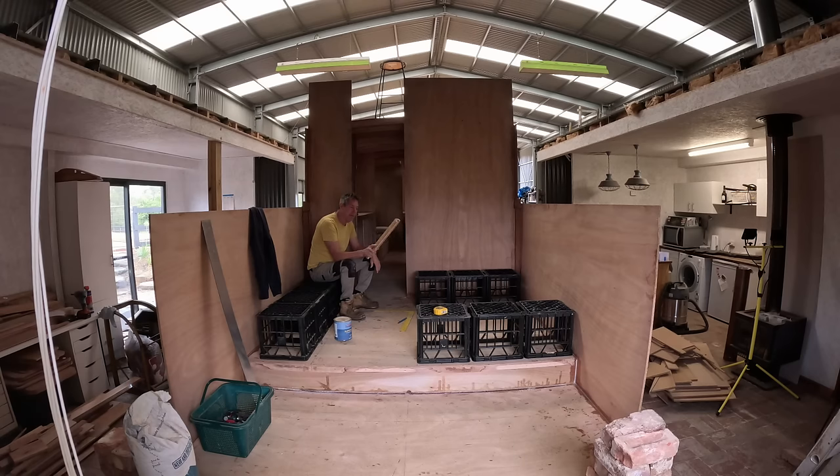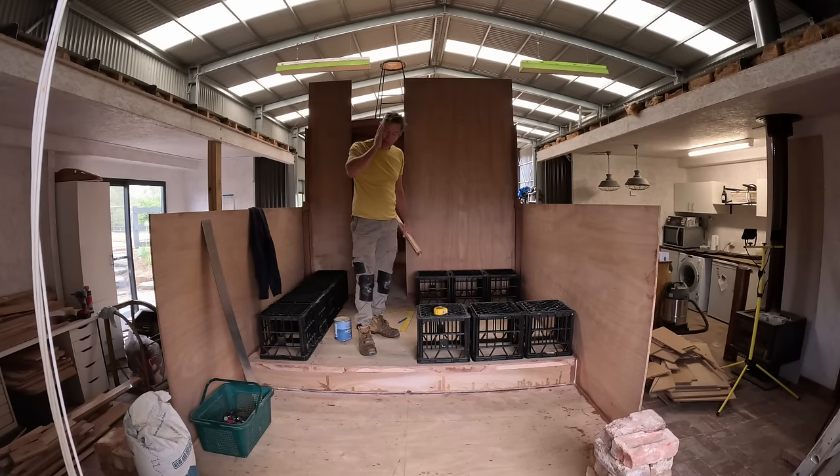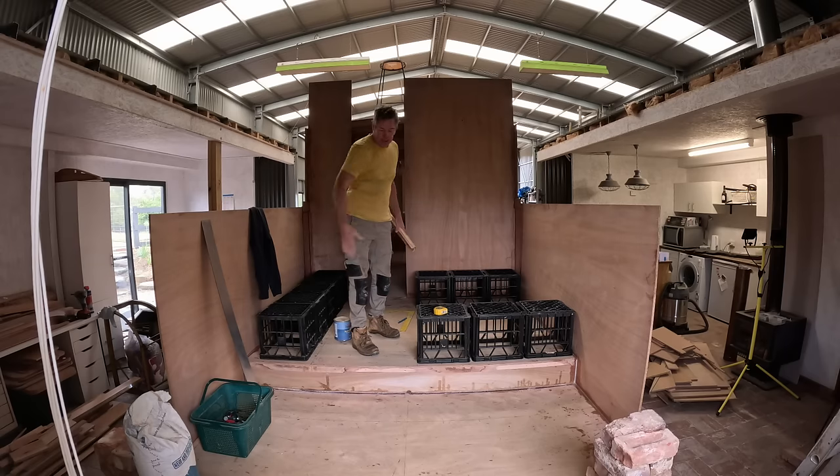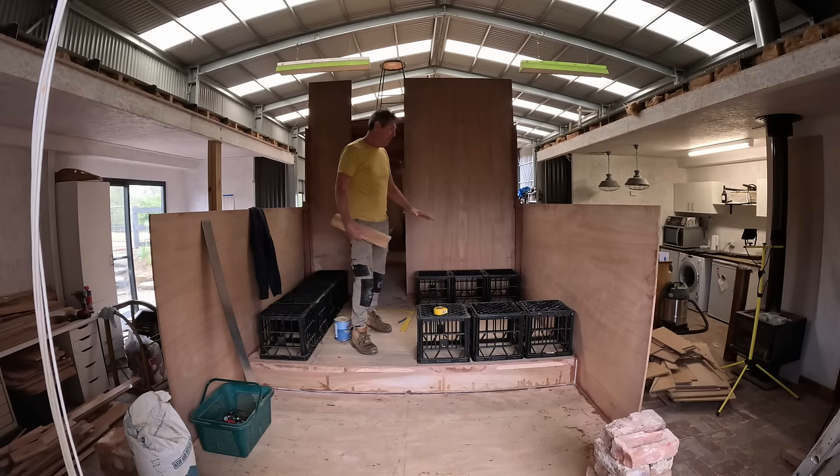Unfortunately, I don't really feel like making up more of these, but I can't put these bench seat faces in place until I have these made. They recess into the ends of these a little bit and then measure exactly for the pieces that go in there. So I'll get all this made, everything in place, then I'll put this bulkhead on here. As I said when I was taping yesterday or the day before, there's no point in putting this back bulkhead in now, because if I do, I've got to step over everything to glue all this furniture into place. So I might as well get this done, everything I possibly can in here, and then put the backing on. Then I'll be finished doing most of the construction inside, except for second fix and fit outs. Alrighty, better get to it.